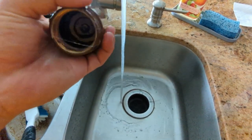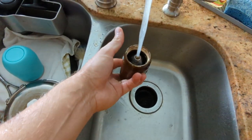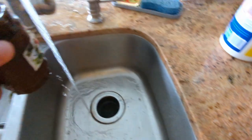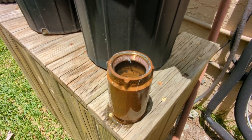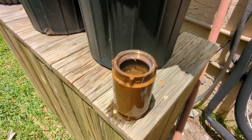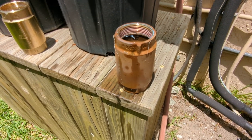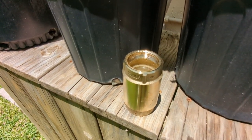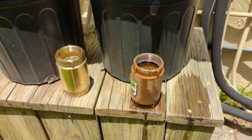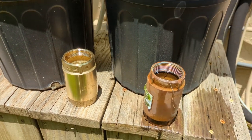We're not going to chance it — we're just going to replace it. This is actually the pickup side, not the side that goes to the pump. But now it's actually sealing. I found these two little pebbles in there — they were preventing it from sealing. Now it seems perfect, or nearly perfect. I filled that check valve up with water to see how long it stays. You can see it's seeping out a little bit. A couple minutes has gone by and water is still leaking out, so this thing doesn't have a perfect seal anymore. Here's the new one by comparison — the deck is bone dry below it. Maybe five more minutes has gone by; you can see the old one on the right is still leaking, while the deck under the new one on the left is still bone dry, not a drop. So we're going to toss the old one.